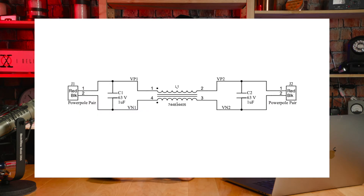The schematic for this board is pretty simple. I put a 1 microfarad capacitor across the input lines. The signal then goes through a dual-wound choke to eliminate any common mode noise, and then through another 1 microfarad capacitor across the output lines. I installed Anderson Power Pole connectors on the ends of the filter board for easy insertion into the power lines.